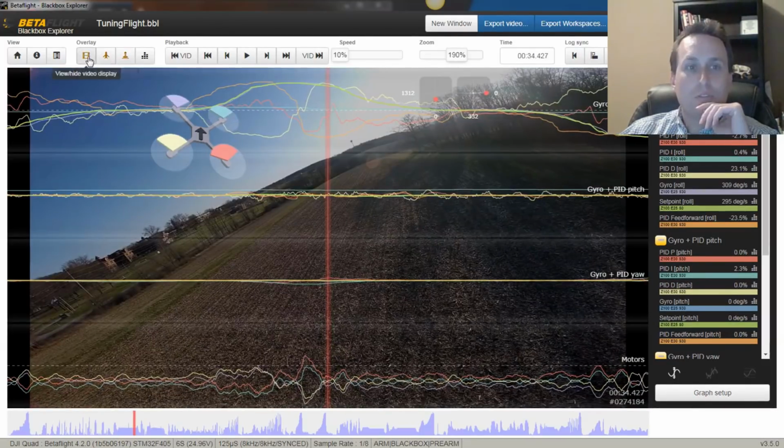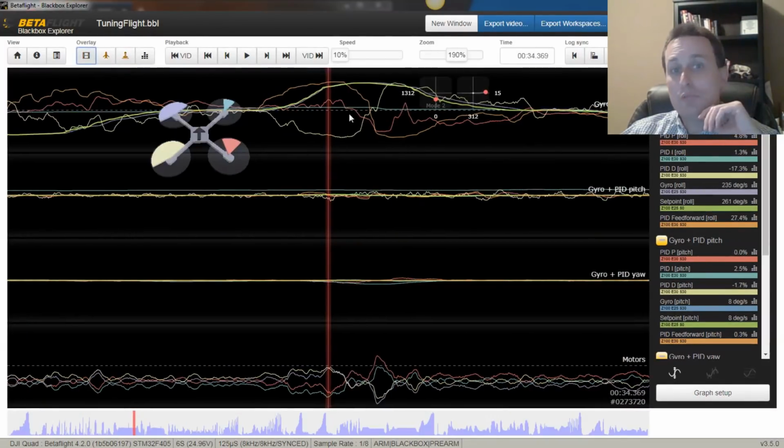One thing you do want to watch out for is if you do get too much feed forward, you can actually have P term fighting feed forward because it's going to be trying to push it past. The gyro would be accelerating faster than you're moving your sticks out. So do look for reversal events where the P term's pushing down with the D term. We don't want the P term to take over the D term's role. If it's pushing down against feed forward, that's a sign that obviously you'd have a little bit too much feed forward gain. You want to back that down a little bit.